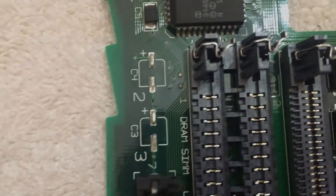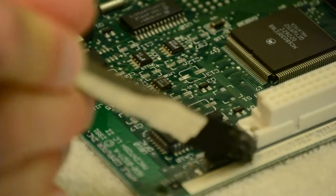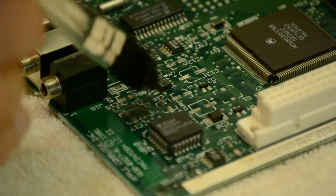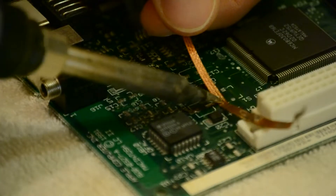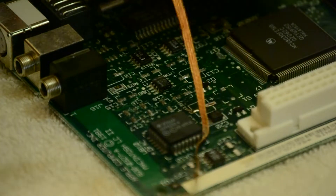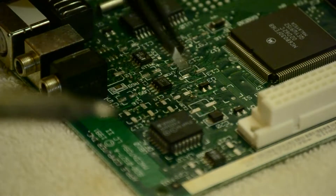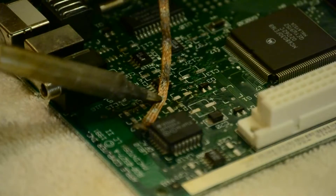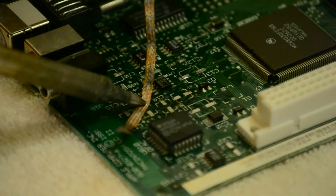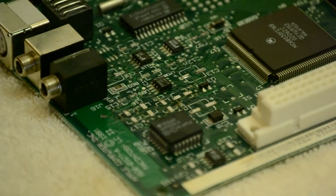While using a dishwasher may seem like a pretty sketchy method of cleaning electronics, the truth is it should be just fine if I let it properly dry afterwards. After letting the board dry under a fan for almost an entire day, the board is looking a lot better — that yellow residue is completely gone. I can now move on to removing the old capacitor leads with some soldering. I first add some flux to the board, and then soldering braid makes quick work of the old leads.